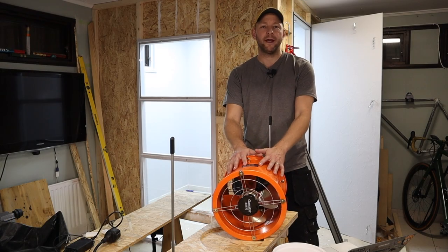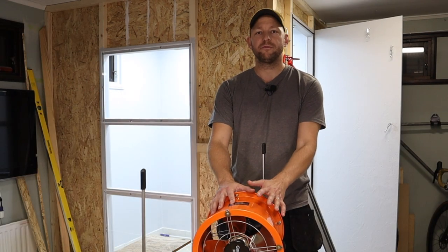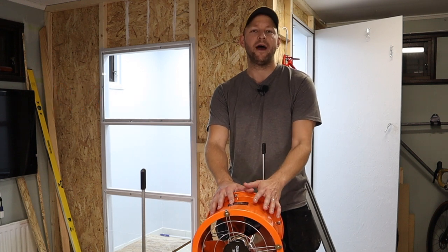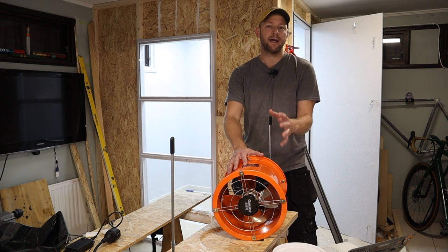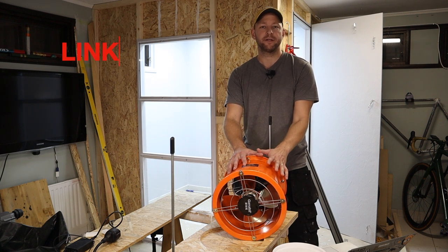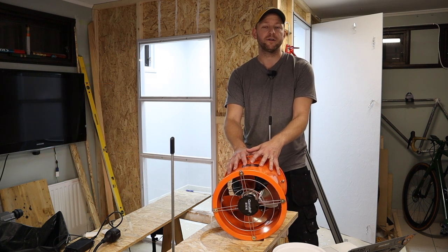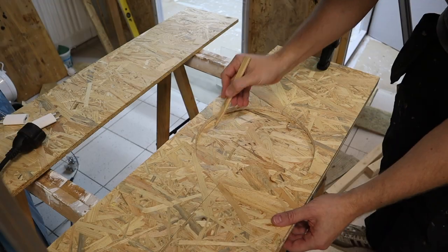The fan I will be using has a capacity of 1,080 cubic meters per hour. Given that the volume of my booth is about 7 cubic meters, it will change the air in the booth two and a half times per minute, which is pretty good. The fan is another risk factor — regular household fans can cause sparks that will ignite fumes and lead to an explosion — so this one is of course explosion proof. I'll put links to all the key materials in the description below, but now I'm going to continue building my fan box.